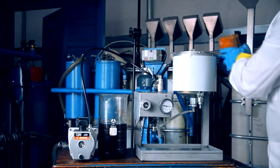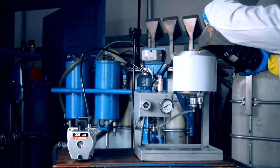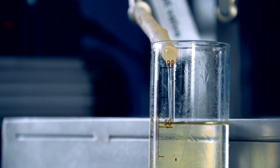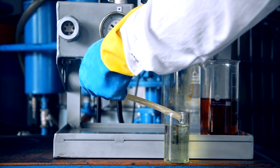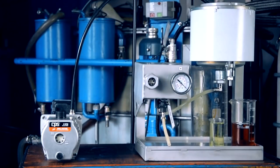One of the advantages of the regeneration unit is the use of Fuller's Earth sorbent, which can be reactivated many times. This gives the unit the capability to process oil continuously without stops to change saturated sorbent. Even after the sorbent is completely exhausted after 1.5 to 2 years of use, it is completely environmentally safe and can be used as a filler for construction materials and mixes.